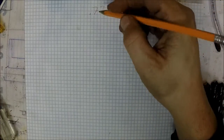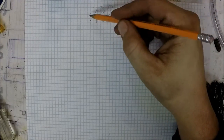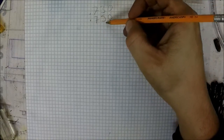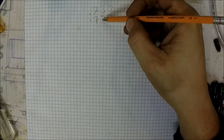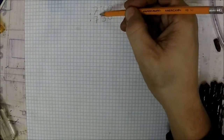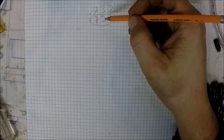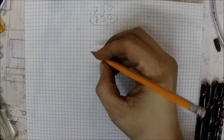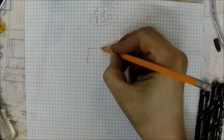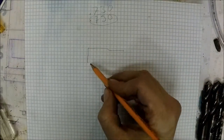So I drill it out to 3/4 of an inch, which is 0.75, and then I'll go in with a boring bar and I will make a smooth cut. So this will get brought up a little bit more, but this is the nominal size. This is the size I don't want to go any smaller than when I make the muzzle brakes. The muzzle brake dimensions, and again, you guys are going to see how horrible my drawing ability is here.